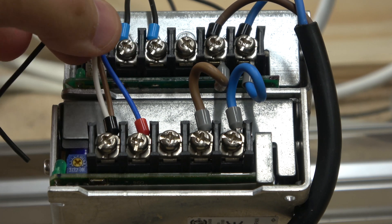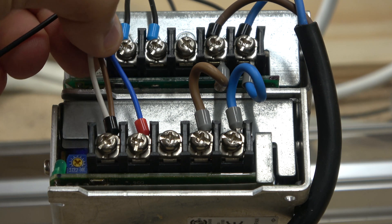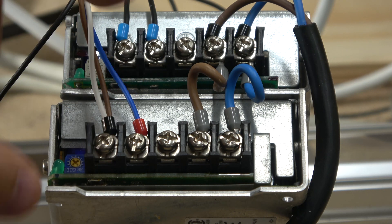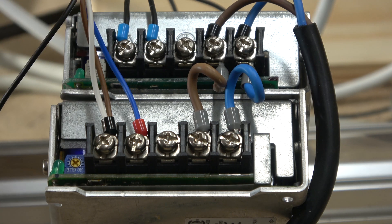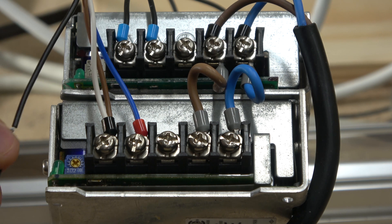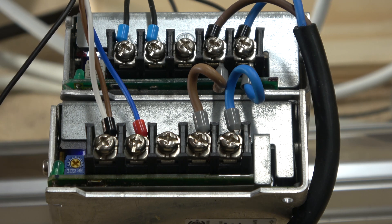As you can see, this cable comes from the controller - it's got four different colors: black, white, brown, and blue. The blue one is your negative part of the power supply going back to the controller. Brown and white are joined together - brown goes to the controller and white goes to the motor, which the controller processes. The black wire, when activated by a 24V signal, releases the brake on the motor. In my situation I don't need it, but depending on your application you might.